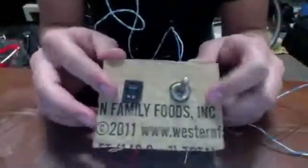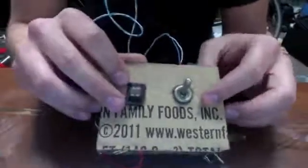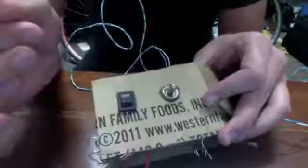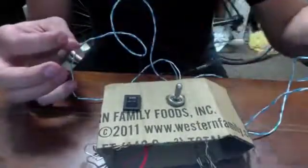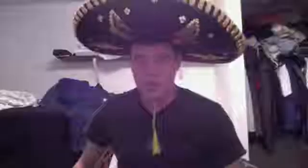If your instrument is set up right, you should have these two switches. Your magnet can be turned on and off with the on-off switch, and your motor should spin one way or the other with your DPDT switch — center is off, up for one direction, and down for the other direction. If this doesn't work, check your soldering or check your alignment of your motor on your setup. If those are correct, then good luck, because those are the main problems that I had. We finished our instrument, and there's nothing left to do but play with it — it's playtime!